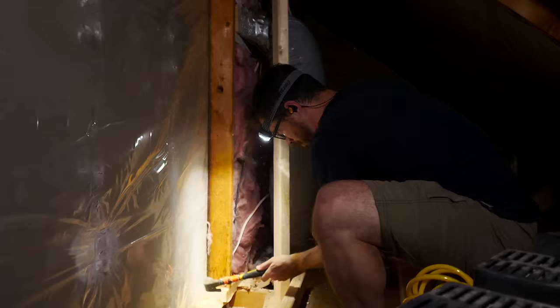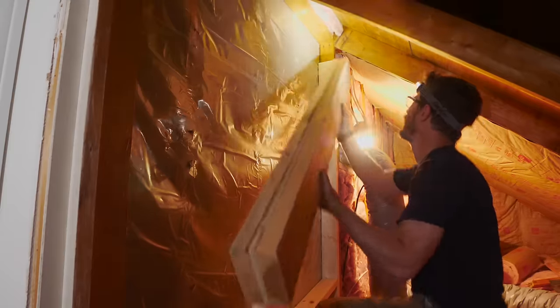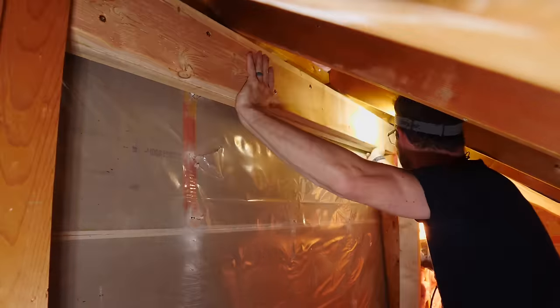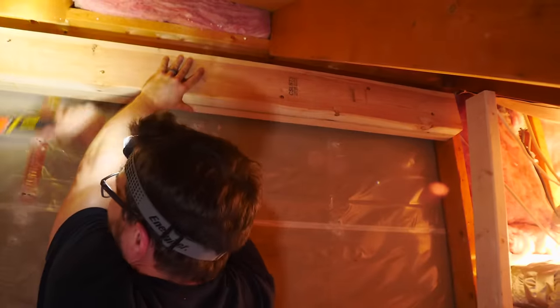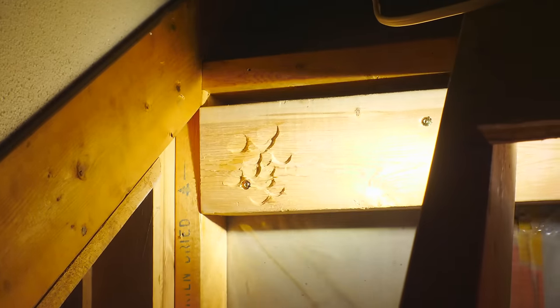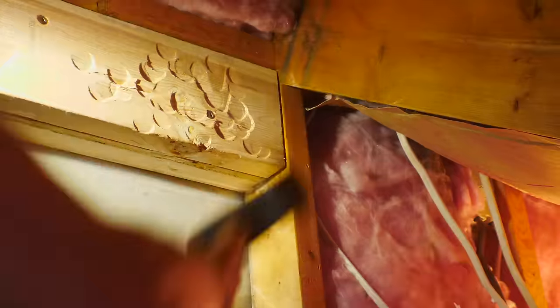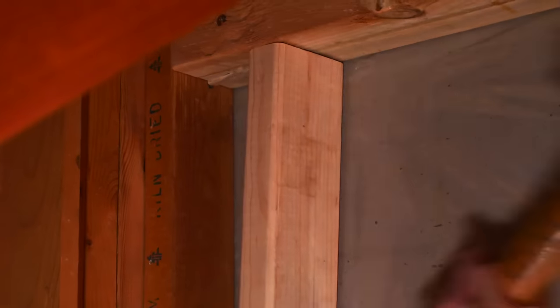After that I got all the electrical wires back up and cleaned up the rest of the opening where my new header was going to go. I also cleaned up the outside edges where the jack studs were going to sit. Then it was time to put in the header — it was a really tight fit, which is a very good thing. You definitely want it to fit well. I ended up getting out the big 5-pound sledge to get it in there. After I got it pushed all the way up and flush with the outside of the studs, I laid in my jack studs. These get knocked right into place underneath the header to support it, then I drove in nails to tie them into the studs behind them.